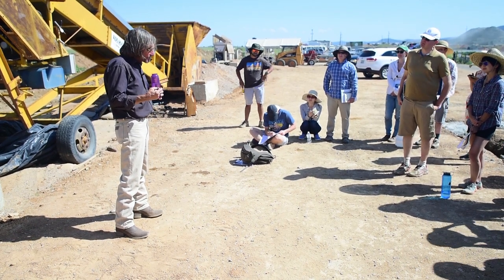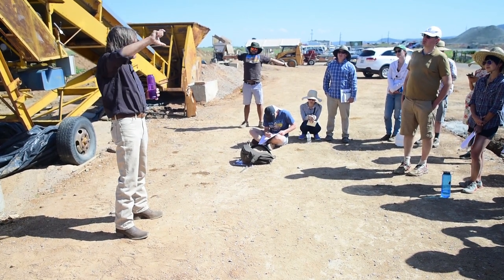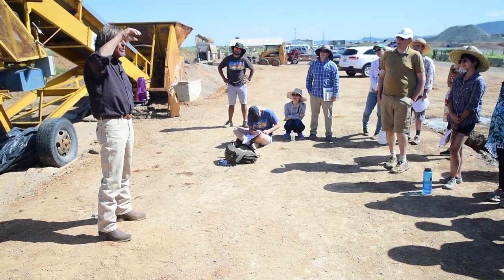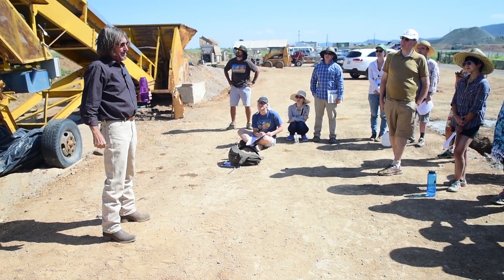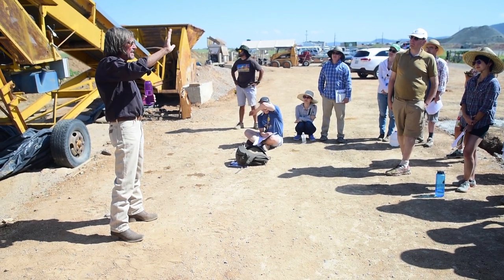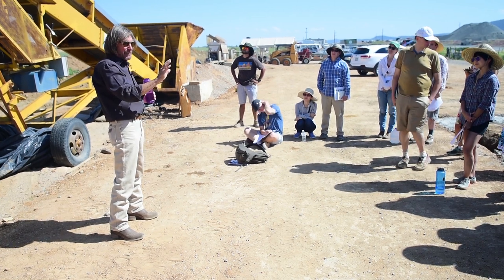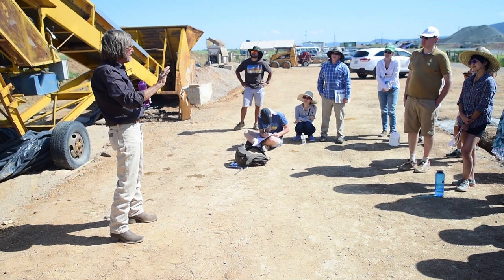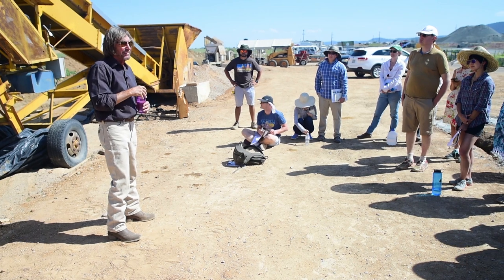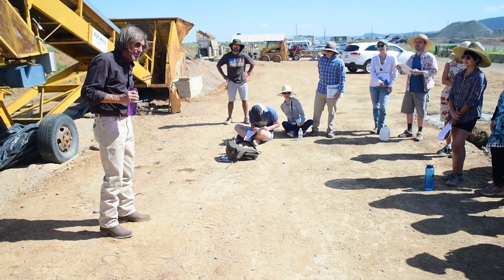Then the other thing is you have leaks in your protection. Like I always tell people, when you have the nice wood lintels over your windows, they're beautiful. Look at them on the inside, because if you leave them exposed outside, it looks great. But what you have at that spot is wood. You maybe have insulation if you're in Colorado. You have earth blocks. You have wire. You have plaster. All these things expand and contract at a different rate in a weather situation. So there's advantages to having them stabilized.